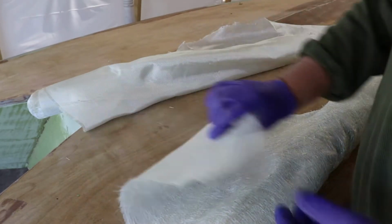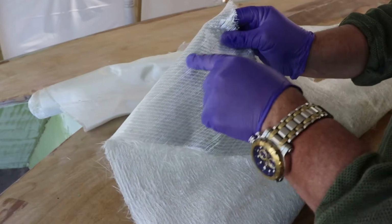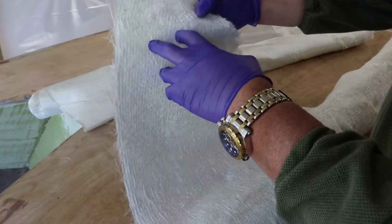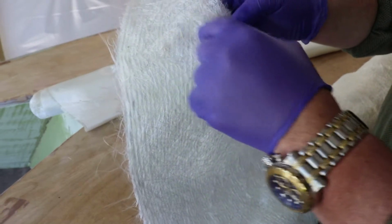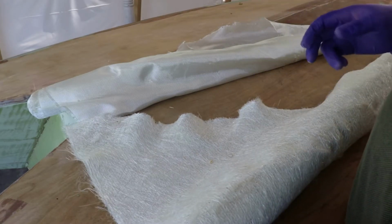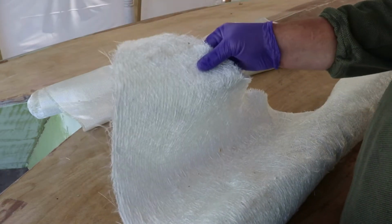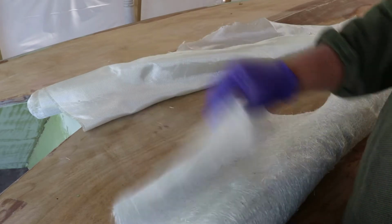So if you look at this, you've got this woven fabric. I used it on the transom in a video, but you've got this really intricate woven fabric, and on the back side you've got your regular stitched-in fiberglass strands, also known as chopped strand mat. So this is 1208, and the thicker one is 1708. Now mind you, this glass takes a lot of resin. I believe 1708 takes like a gallon per square meter to wet out, so that takes a lot.